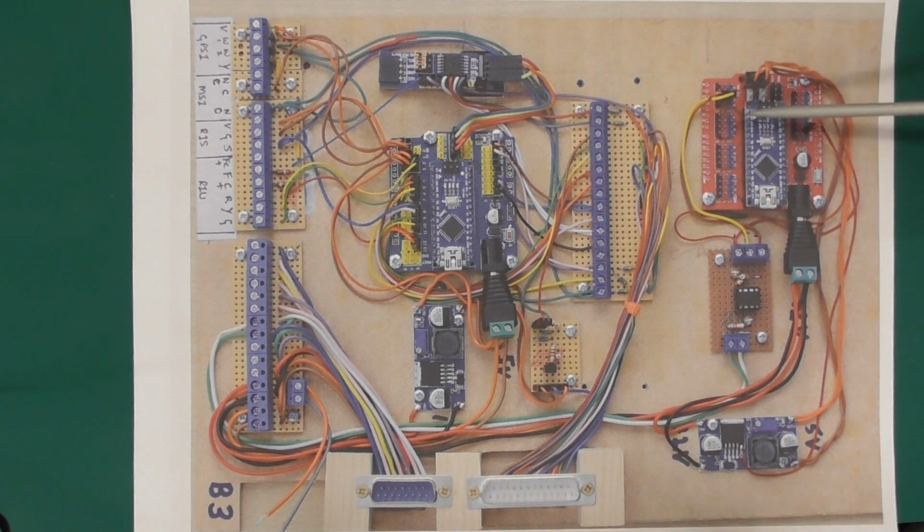So I won't go into that any further, but the servos all plug in, 11 of them plug in up to there, and the 12th one plugs in here. Yeah, this drives the pin over there. The yellow wire is the input to the Arduino from this, and the Arduino decodes the DCC signals. You can set its address up to be any accessory address you like, and it will simply set the first servo to that address. Servo number 1 is here, or number 0 if you like, up to 11, or 1 to 12. It sets the first servo to the address you give it, the second servo to that address plus 1, all the way through to the last servo, which is that address plus 11. So that gives you 12 accessory addresses, and you simply send a 1 or a 0 as the command, which sets the accessory one way or the other, which causes it to move the servo.